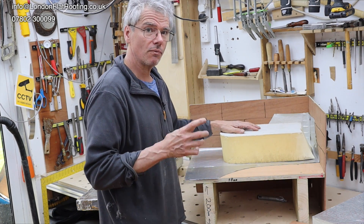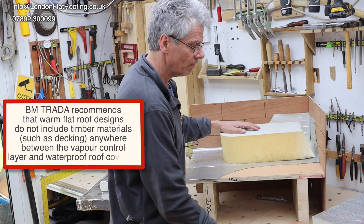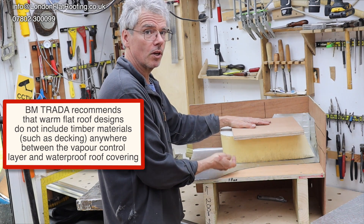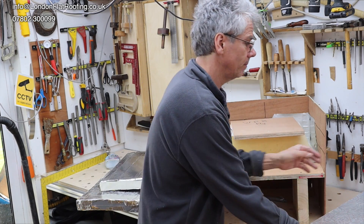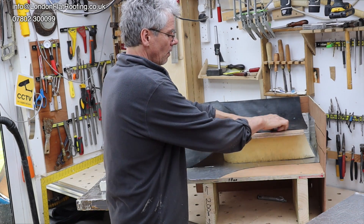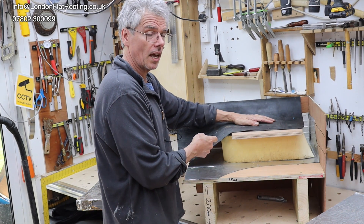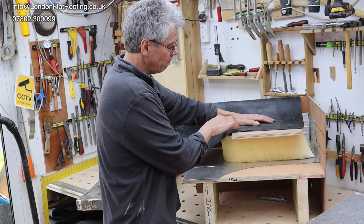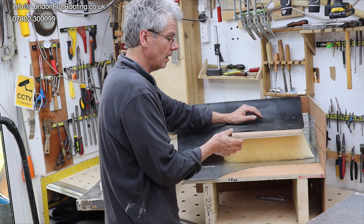The reason is that the best vapour barrier in the system should be at the bottom. New information coming through now is that you shouldn't be putting ply on top, because the vapour barrier helps reduce moisture coming up. Any moisture that does come up should get out the top — you've got a membrane over the top, and that membrane has a vapour resistance. The insulation above should have minimum vapour resistance so any vapour that gets through can escape.